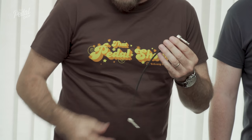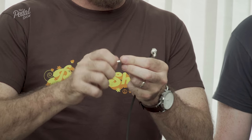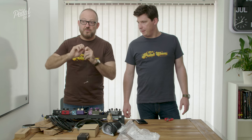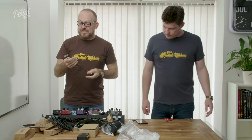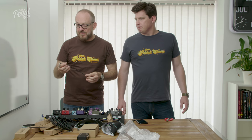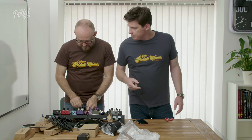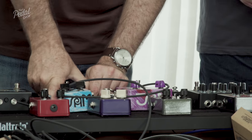And then you screw that on, you bend the cable over, and then you just put the cap on, and you have a fantastic patch cable. I was using the Monorail cable for years when I was doing soldered leads, because I just didn't like any solderless stuff. But then they came out with this, and I was totally sold. I've done thousands of these over the years, never had one fail. Expensive, isn't it? It's not cheap. The only time they fail is when I make them. Like everything else, there's a knack. There's human error.